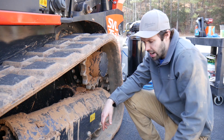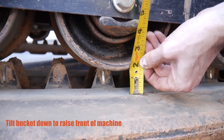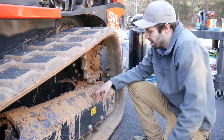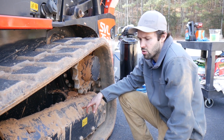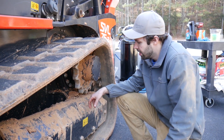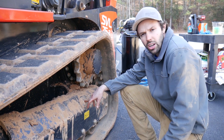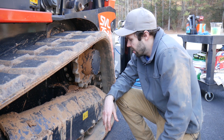All right, so now we're going to tension the tracks up a little bit. We took a measurement from the second idler — from the bottom of the idler to the top of the track — and we're sitting right at 1.5 inches. We need to tighten that up by about half an inch. This guard plate protects the grease fitting that is responsible for tensioning the track — grease is really the only thing tensioning these tracks. There's a plunger that is forced out towards the front of the machine as more grease is applied, and as that happens the track draws up closer to the idlers. We're going to take these two bolts off, access the grease fitting, use our grease gun, and keep adding grease incrementally, taking measurements until we're between 0.8 inches and 1.2 inches — right around an inch.